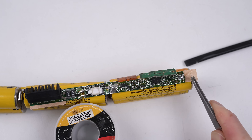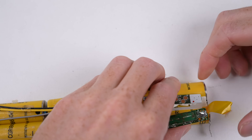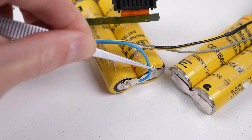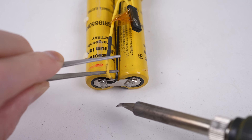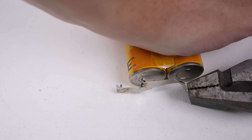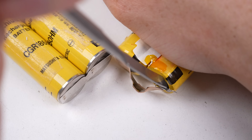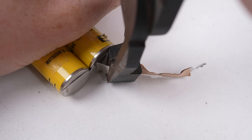There are two tabs directly soldered to the board, and an additional four wires running to other sections of the pack, which need to be unsoldered to separate the BMS from the old cells. I thought — why do more work than necessary? I'd reuse the old nickel strips linking the 18650 cells, but in trying to break the welds free, the strips weren't holding up. The first one might have been salvageable, but the second one snapped in half on removal.